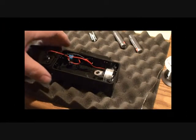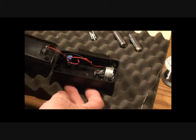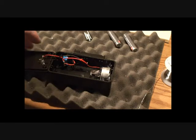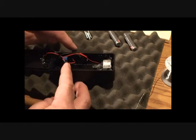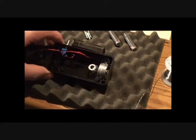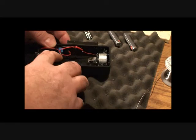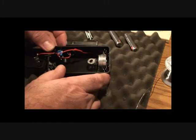Here's the assembled, wired unit. The red lead from the motor goes to the outside post of the switch. If you're installing an LED, take a lead from that post to the positive lead on the LED — the longer lead is always the positive lead. Then take the black ground wire from the motor to the black wire from the battery holder, and run an additional lead from the ground to the negative lead on the LED. To recap without LED: battery red lead to center switch post; motor red lead to outside post; battery black lead directly to motor black lead. That's all you have to do.